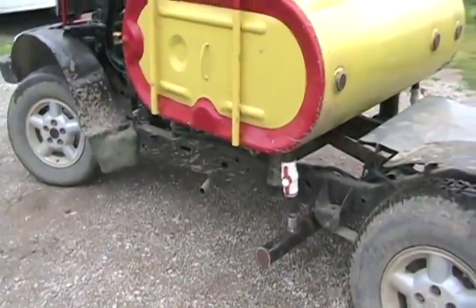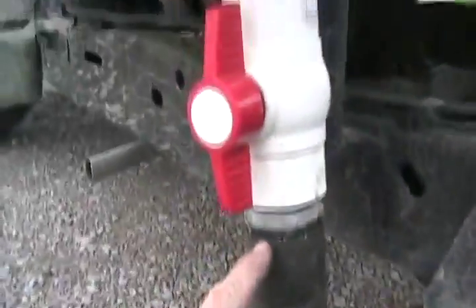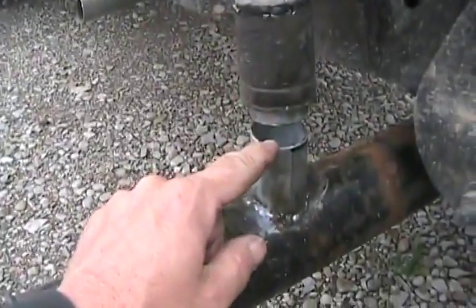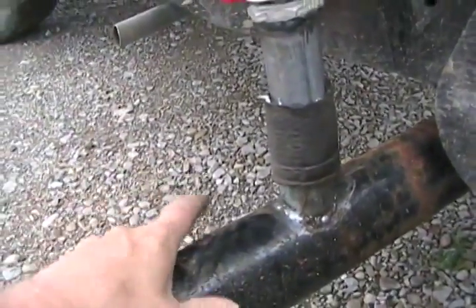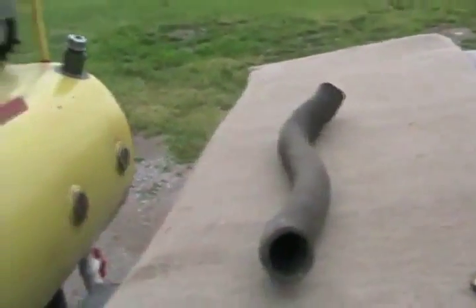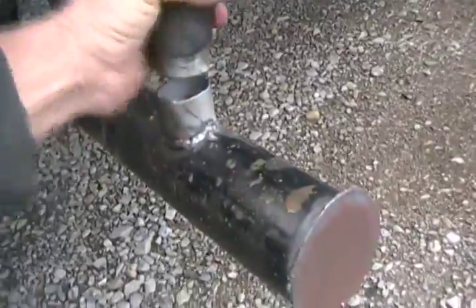I left a space here because good engineering means everything flexes. Even though this tank is welded to the frame in a rigid way and that pipe is welded to the frame in a rigid way, everything flexes. So there's no way I could weld the pipe from here to here solidly. I got some rad hose which I just slip down there and put a couple of clamps on — there's a half-inch flex joint so that'll never cause a fracture in the future. It's just old rad hose I save from every car I scrap.